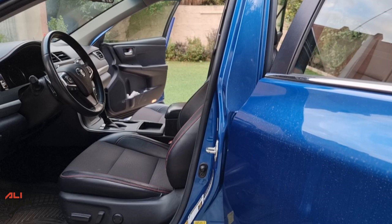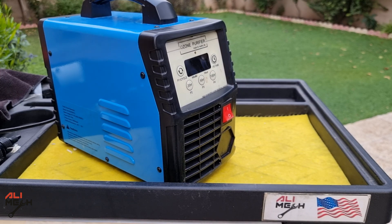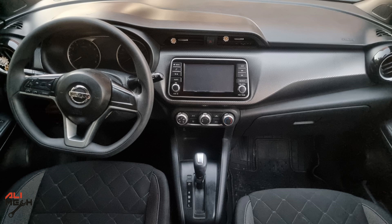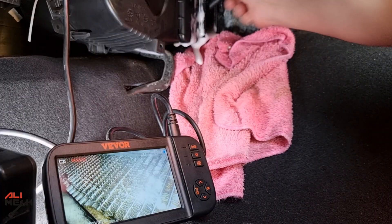By doing this procedure, it will kill any living bugs in that area and also the bacteria that create molds. So when will this ozone generator not work for eliminating smell? Well, if you have a car that's been smoked in for many years and the AC evaporator is covered with nicotine, this ozone generator is not gonna do anything. I tried the same procedure on this car, even left it for an hour, and it didn't do anything. Unless you do a deep cleaning for the entire air conditioning system and the vents, and then use this ozone generator. I have a detailed video about air conditioning evaporator cleaning — I will put the video in the description box below and YouTube card if you want to check it out.